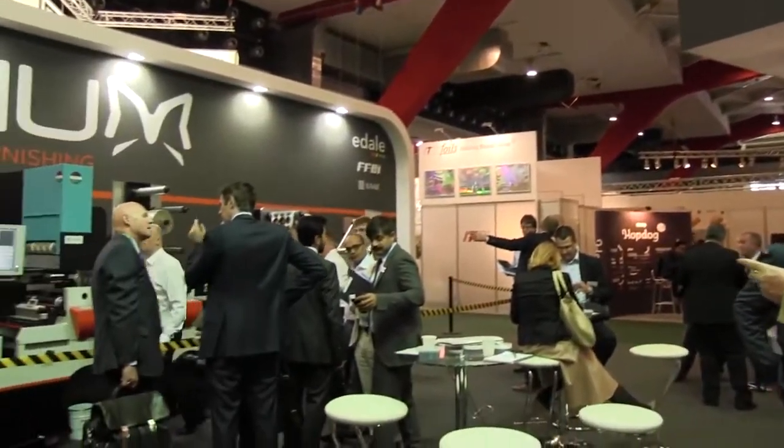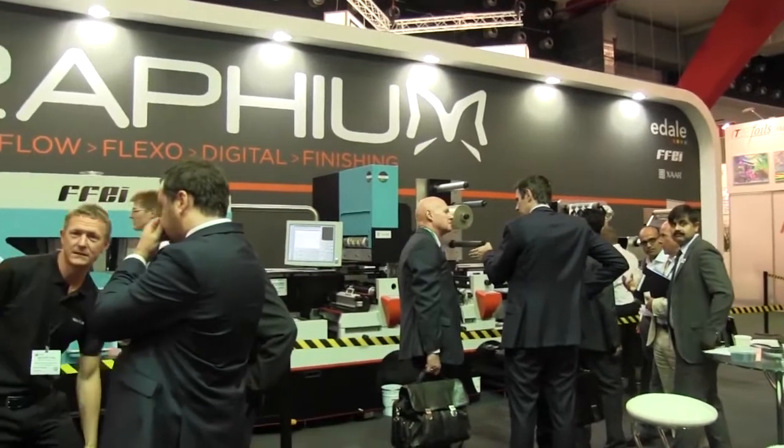We would recommend TruePoint Orange to our customers because of the safety features — not cutting yourself on steel doctor blades — and we're getting much more life out of the blade. I like to make sure that our customers get the best value for money, maintain the high level of print quality we produce out of our machines, and we've got a lot of concerns of safety. A lot of times people get cut with stainless steel doctor blades, so we don't find that at all with the orange tip, and we get a nice clean wipe of the Anilox roller.